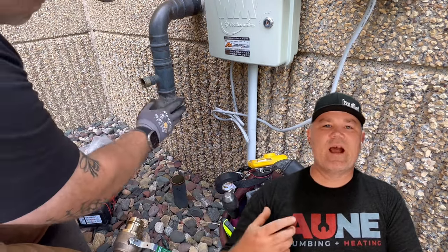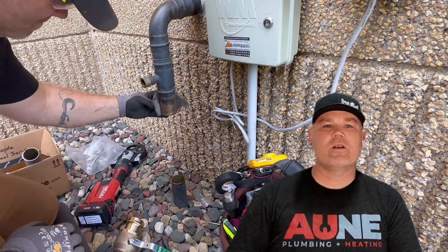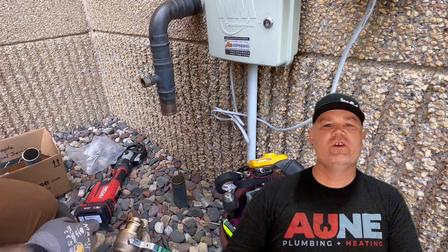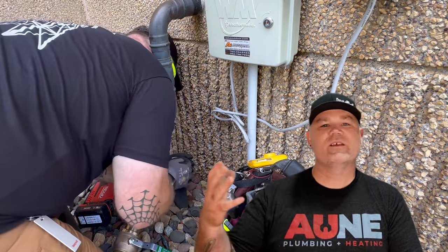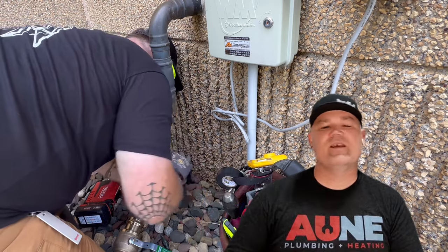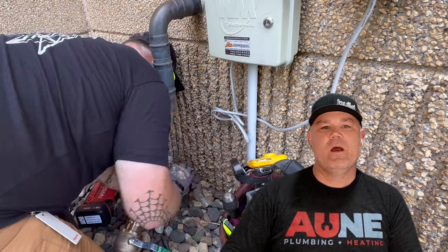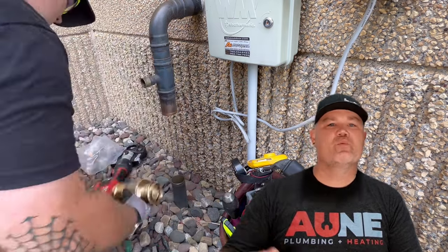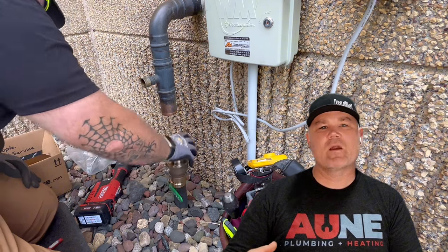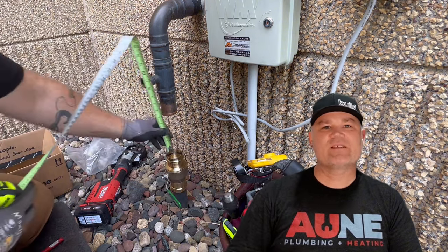I'm cleaning the copper just a little bit with some steel wool. I'm not sanding it down or anything — I'm just cleaning the oxidation off so I can make sure everything is good with the copper and there aren't any big gashes in it, paint, or whatever might be on the pipe. Prepping the bottom cut now, and then I'm going to place the valve on there temporarily so I can get a proper measurement for my next piece of copper.